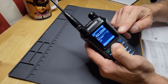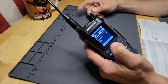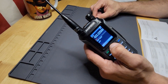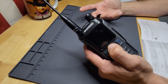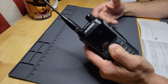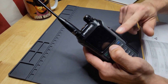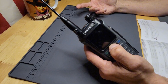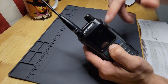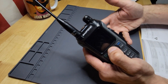One of the things I noticed in this menu is something this particular model doesn't have. The UV-21Rs come in an M-Mike version or an L-Lima version. If you have the Mike version, it actually supports AM 108 to 136 MHz for airband AM listening, police band 350 to 390 MHz scanning reception, and voice scrambling functions. There's a scramble menu I do not have on this model — it's a voice inversion function that enables private communications by scrambling voice signals. Bummer — I don't have that one.